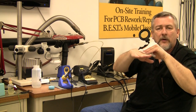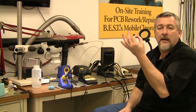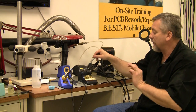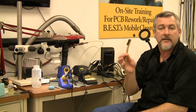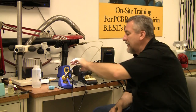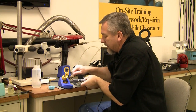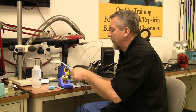If oxidation occurs, they make tip cleaner — comes in a little container and you can stick your iron in it and clean it up really good. But there are acids in there and they can reduce the thickness of the plating on these tips, so be careful. What I like using is this brass brush. I can scrub with it going away from the body to clean that tip of any oxidation. Then grab some solder, saturate the tip, and make sure it's solderable again. These are my conductive systems — making direct contact with the area where I'm soldering.